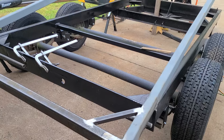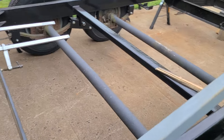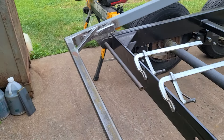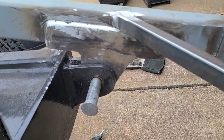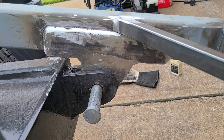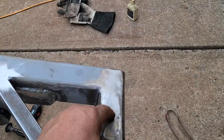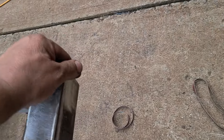I've got a variety of tools out right now - just a 1 and 1/16th pin holding in here and an actual pipe over there. I'm lining it up, and I really think that adding those angle irons to the actual pipe is going to help where it hinges. We've got everything here welded in. What I did was I cut this pipe and notched it over so that this covered the end cap.